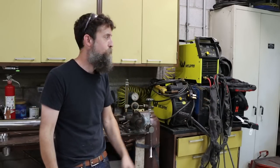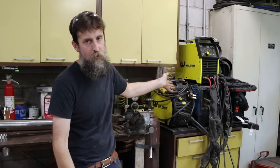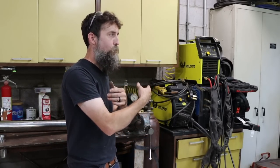I mean, if you just go by what the books say, then you're probably using too much. That's what I'll say. Same thing with a MIG welder. If you're set up for running big fat beads, you've got big molten puddles that take a long time to solidify, yeah, you're going to need quite a bit of gas flow there. Versus if you're doing spot welds with a MIG welder, like I'm doing body work, well, they may solidify in half a second.